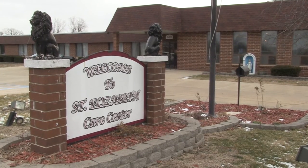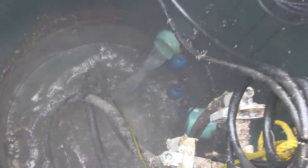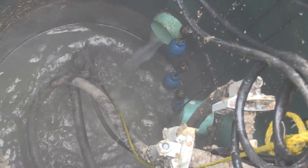That's why I came to see the city. They agreed to let us install one at a local nursing home. They had gone through approximately six pumps at that nursing home in three years. We installed one at no charge to the city and left it in for six months. We discovered after checking it each month that this nursing home was producing about 400,000 gallons of wastewater every month, and this pump was running about 18 hours a day — but it was keeping up with it. After approximately eight months, the village agreed to purchase that pump and allow us to put a second pump in. That second pump now has around 400 hours and the original pump has around 2,200 hours, so these things are running around nine hours each day and it's just doing a fantastic job.